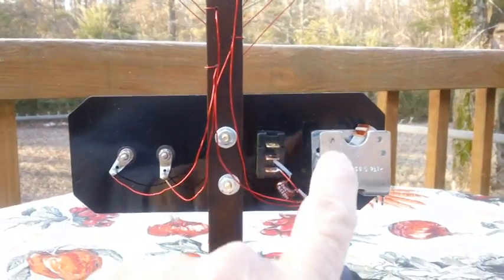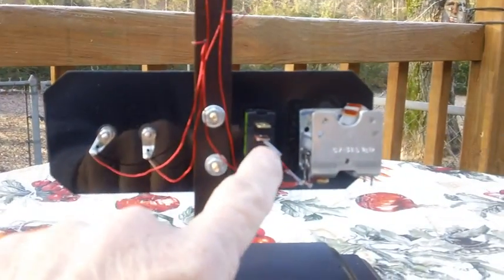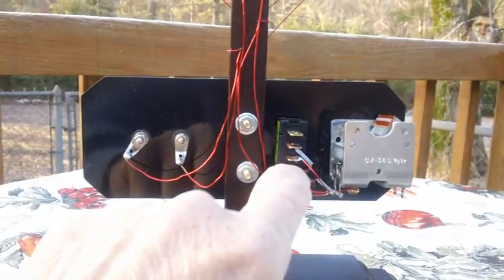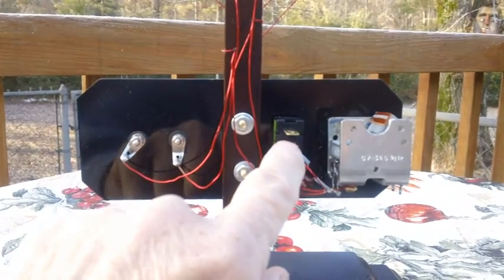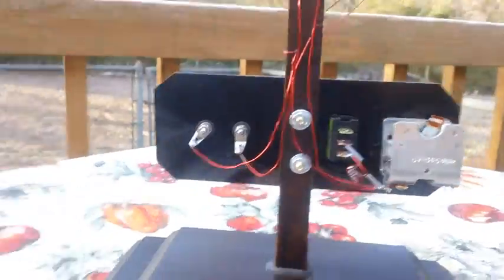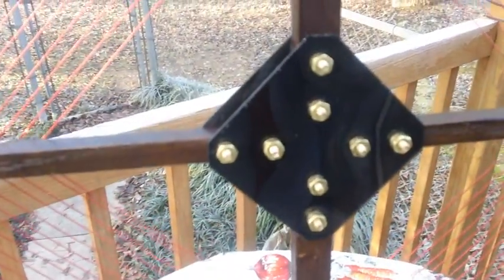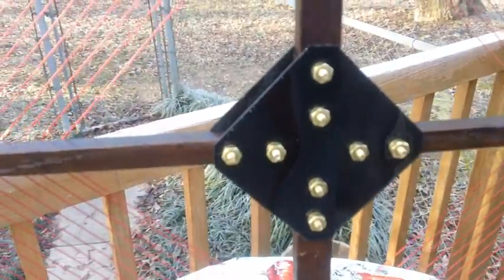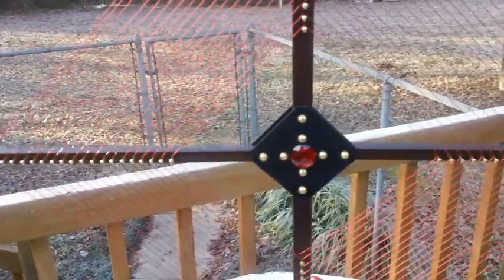On the back, here's your tuner right here. Here are the back of the two banana plugs. And of course here's your on-off switch — any switch would do. And there's the 360 picofarad capacitor that runs — that this switch controls — that throws it in parallel with the tuner. Up here, these are all the nuts and everything, standard operation procedure. Just make sure you use lock washers with them. You don't have to use brass — I like to use brass. I'm kind of a brass nut, for those of you who follow my videos.